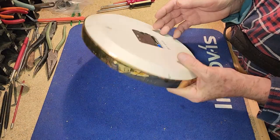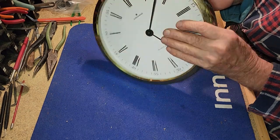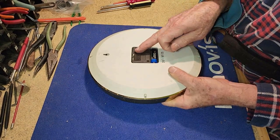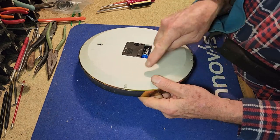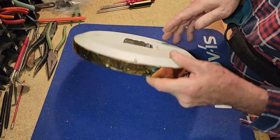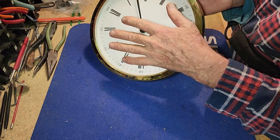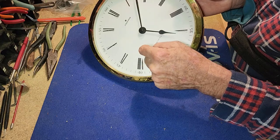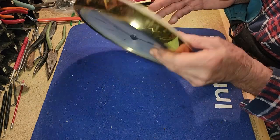I'm going to take the movement out of the clock housing, and to do that we need to take the hands off. Perhaps the back cover comes off, but I'd rather take the movement out — we'll get a good look at it. It looks like there are four Phillips head screws holding the front surround on. The glass should come out — it might be glass, might be plastic — but we'll need to get those off to get the hands off, so we'll do that first.